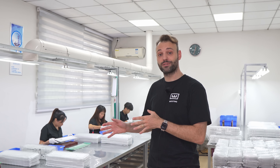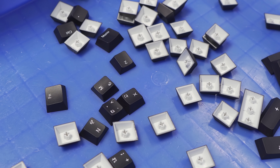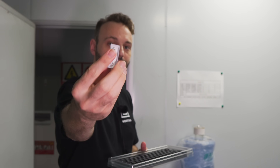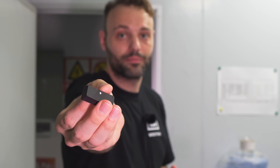Now we're at the dye sublimation manufacturer. Dye sublimation is used for the keycaps made for the Japanese layout, which you can also use on a US layout. Here you can see a white keycap that becomes black on the outside with a white legend. The way we do that is by making a single-injected PBT white keycap first, then dye sublimating the outside on all five sides, leaving the legend open — which remains the original keycap color.